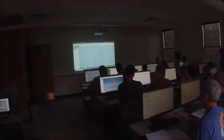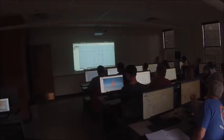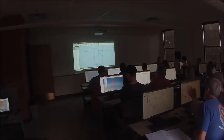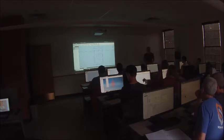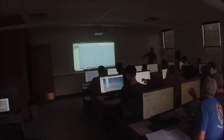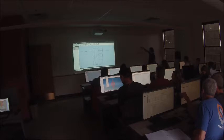All right. We're gonna finish the model of this plate here so we can get some geometry in 3D. Now we downloaded a bunch of bearings. We've got to have holes that those bearings go into. Now we talked about bearings in our second class. I'm gonna go over it a little bit. If we look at the bearing from the side, it looks like a little hat almost. It's a really out of scale drawing, and then they have a hole through the middle.